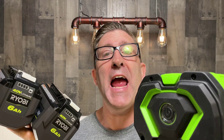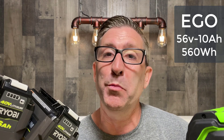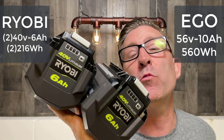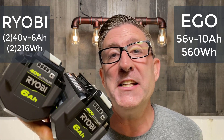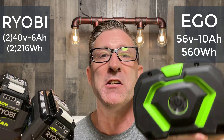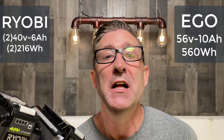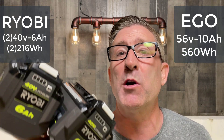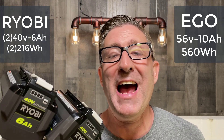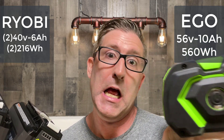Time-lapse is absolutely riveting, right? Let me summarize what we just saw. Over here I have the brand new 10 amp hour, 56 volt Ego battery included with the 2021 dual blade mower from Ego. And over here I have the two Ryobi batteries — 40 volt, 6 amp hour — totaling 432 watt hours. This big one here totals 560 watt hours, so this battery has more power than those two batteries combined. And this battery on the turbocharger was able to charge in less than half the time. The two Ryobi batteries required babysitting — you've got to swap them out halfway. It's kind of a pain. So at the end of the day, I know what battery and charger I prefer.